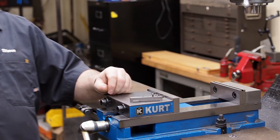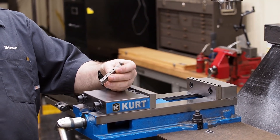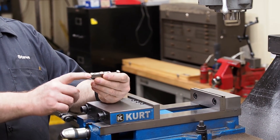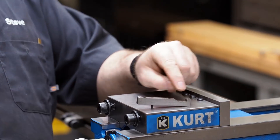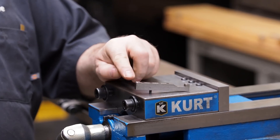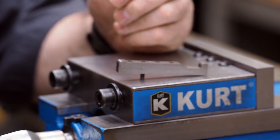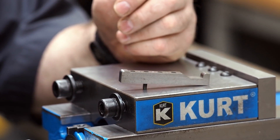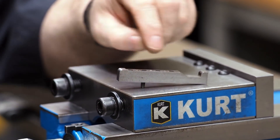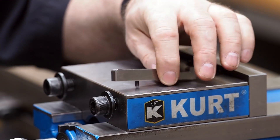Here's a three-inch sine bar that a co-worker years ago made for me. It's a unique design — he ground the radius here, and the radius here. I've never checked it to see how close this was. I would never use it for precision work anyway, just for some stuff where I needed a tight space to work with. This is supposedly made three inches from center to center.